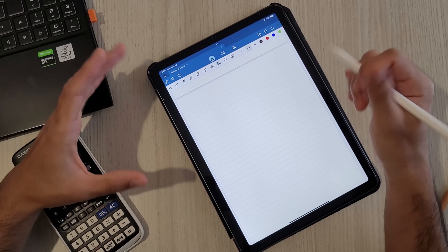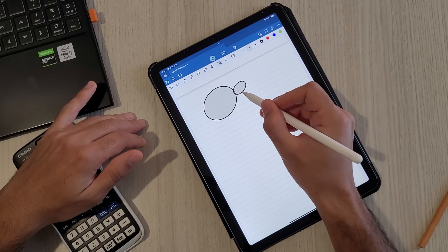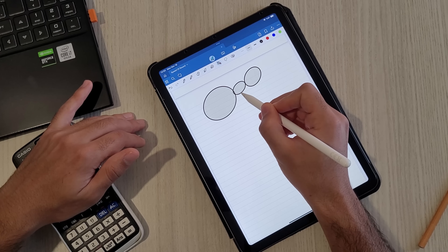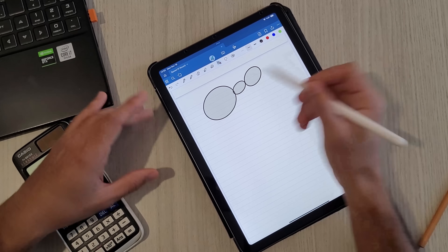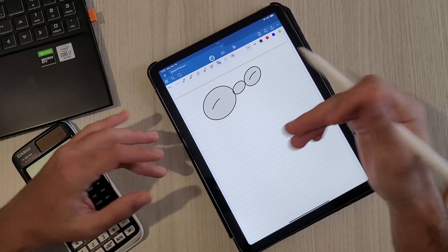For that we need to do some calculations, because it's only intuitive for us to guess the ratio between two gears — but with multiple sets it's not intuitive. When a gear spins another one, we get a gear ratio. But when we add another gear directly to it, the size of the center gear doesn't matter — it only serves to transfer the rotation, and the ratio simply becomes the ratio between the first gear and the last one.